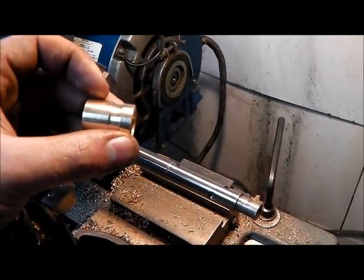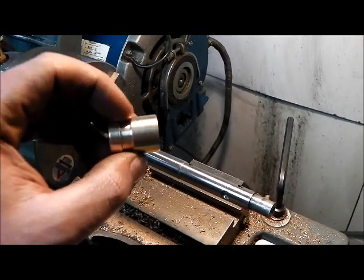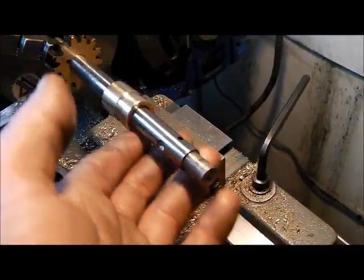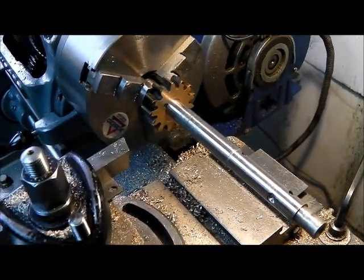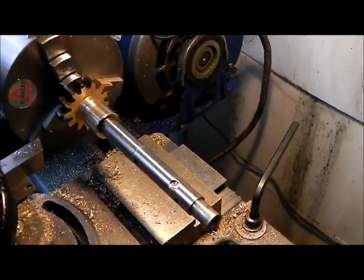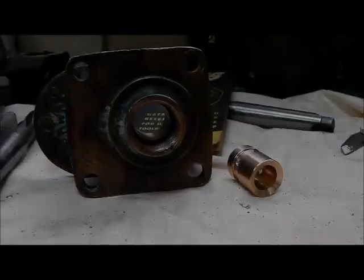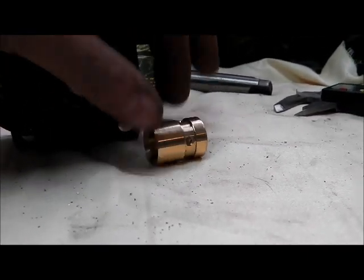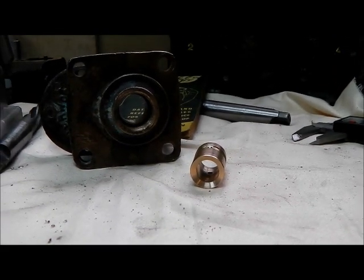I haven't gone into great detail over making the bronze bush simply because I've done this loads of times before on camera. The groove on the outside is for the grease — we're going to put a drilling in that. It's a nice fit on the shaft now. Obviously the shaft isn't perfect — it's been rusty at some time — and I've machined a step on there to actually get the bush on because it was so badly gnarled up. Given that it's grease-lubricated I'm quite happy to use it for now; I might make another at some stage. I've just drilled four holes through there which will do for the grease. I could put a groove the full length of it but with the running clearance it's got it should be perfectly fine.